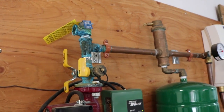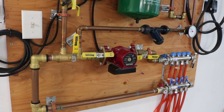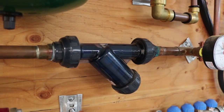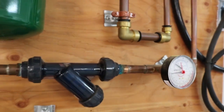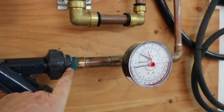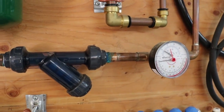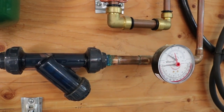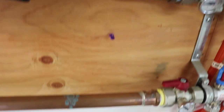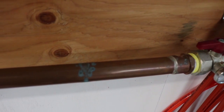The other spot I had trouble with: pretty much all the parts on here — the brass, metal, stainless steel — are good components, with the exception of this Y strainer, whose components are plastic. I did get a tiny crack right in there, so for a while I had a slow leak that dropped the pressure a little bit. Once the pressure dropped it stopped leaking, so it hasn't been an issue, but it's something I keep an eye on. The glycol is blue, and when it drips and dries you will find it — it leaves a mark.